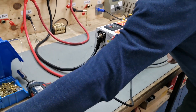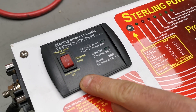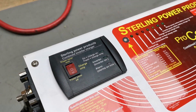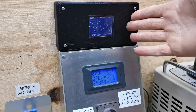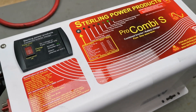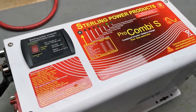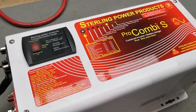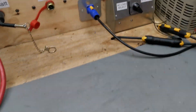Let's go on to the third and last setting, which is power saver off. Treat this as a simple run button — regardless of the output load, if you switch it on it will provide AC power all the time to the output. You can see on the output we've got our pure sine wave being displayed. This unit will now be inverting, and it will also act as an automatic crossover switch should you want to put AC power on. If we flip the switch, it automatically clicks over — it's now becoming a battery charger and letting the AC come through the unit onto your AC system on your vessel or camper van.